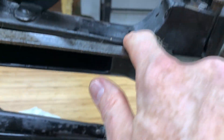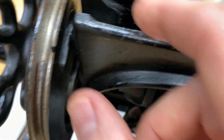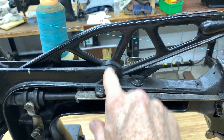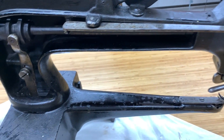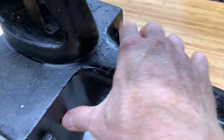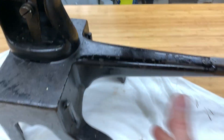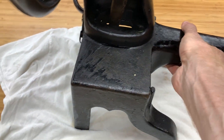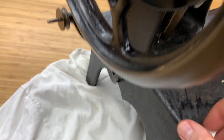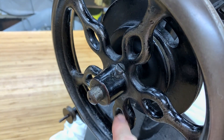On the 29-4, there would be extra metal over it with a little plate, but on the 29-2 it's all open and skeletonized, which I kind of like because it's way easier to oil. You can see all the parts — your shaft runs all the way through there. You just have oil points here and here, and another oil point for this. Going down here, it's easy to get to. There's a big arm on a pendulum with a focal point, and this goes up and down pushing your needle. These are the little posts where a flat plate would go to make this flush.